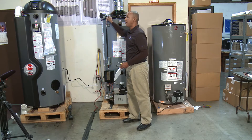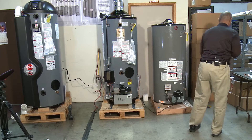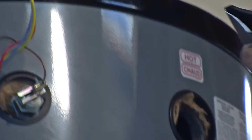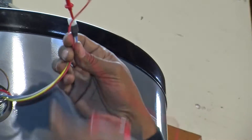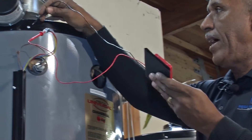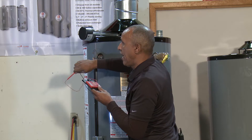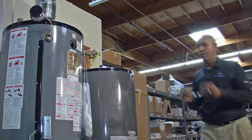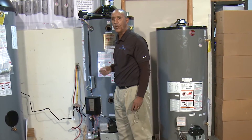You can take your multimeter, pull the plug off a connector, and plug it into the connector — the connector prongs are ironically the same size as multimeter points. Find somewhere to ground the negative lead and test for 24 volts. You will find that blue wire running throughout the entire system, and you can test 24 volts at each one of those points.